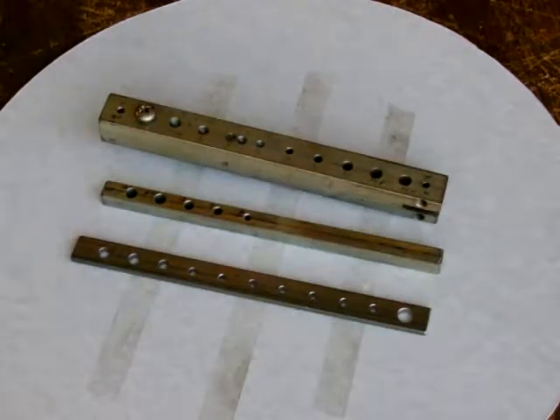This is about cutting off and chamfering small bolts and screws. I don't have a lathe, so I used three blocks combined with a hand drill to do it. The blocks have clearance holes drilled at one end and tapped holes on the other. The smaller, thinner one at the bottom has only smooth holes just for supporting the end of the bolt or screw as you're running it on the grinder to chamfer it.